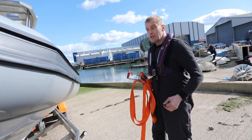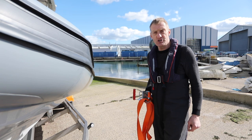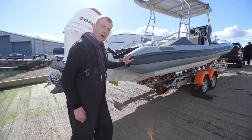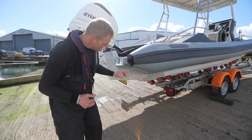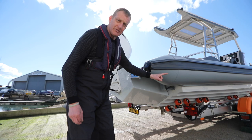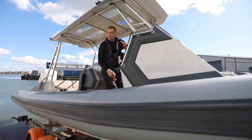Another nice feature on our stainless trailer — nothing is rusty, everything's really super. So now we're ready for our driver to just push us down to the waterline. Off with the bow strap, hop in — obviously make sure the batteries are on, I did that before I could lower the engine. We'll get it just wet enough that I can drop the engine, start up, and then reverse off in one nice smooth movement — that's the plan. Key thing: just make sure the bung is in. This one's quite unusual, it's fed in from inside, right at the bottom. Don't forget to move your chock either — bung in, chock out — then it comes down the slipway and we'll be ready to go.